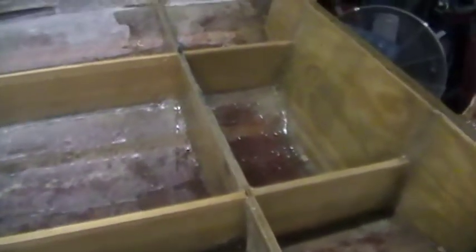You don't have to keep fighting to get little tiny air bubbles out. What I did was take my roller and keep putting it on an angle, squeegeeing stuff out as I came back, so it kept saturating the top with resin over and over. Then I worked the bubbles out from side to side. The first one took a lot more effort and a lot longer than it should have, but the rest of them went really well.